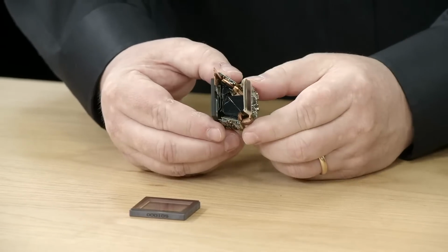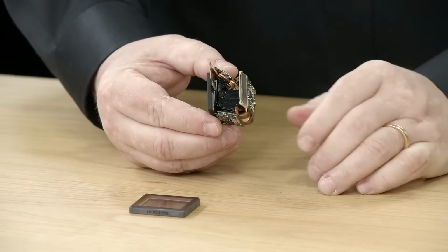The problem with that is you get optical distortions. Also you've got 3 sensors, so it's higher power. So what we thought would be a better idea is to use 12K, which gives us so much extra resolution that essentially it's full RGB, and it's in a single sensor. So it's kind of a bit like an electronic, or kind of a solid state prism. It's like a virtual prism in a lot of ways, but we don't get any optical distortions. So it's kind of, we think, a nicer way of doing it. Plus, of course, you've got the extra resolution as well. So this is really the reason why we went so far beyond 8K. I mean, 8K is a feature film resolution, but we thought let's go beyond that.